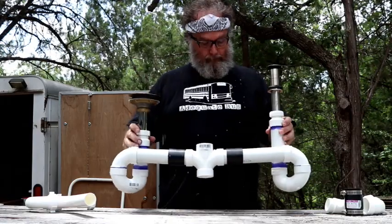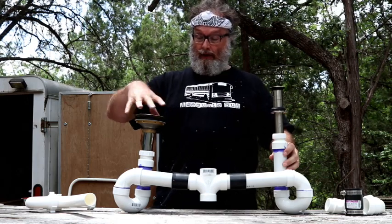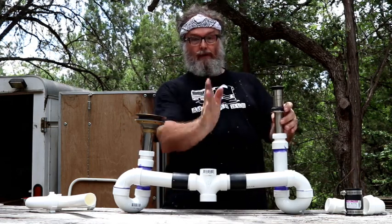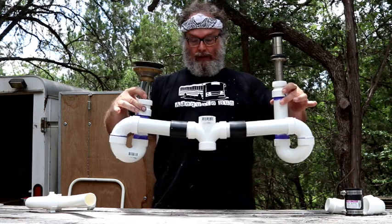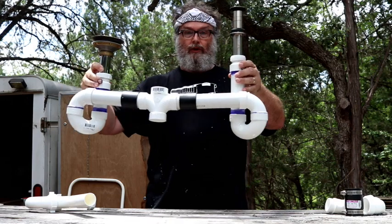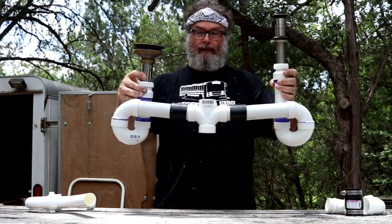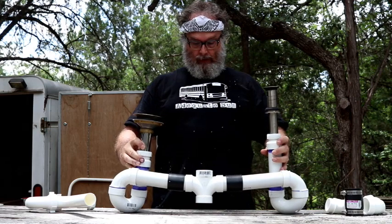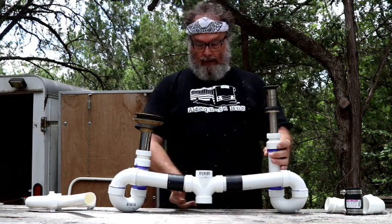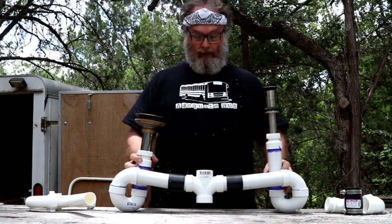Here's another assembly. This is the kitchen sink, which is a very deep sink. This is the bathroom sink. There's a wall right here — a hollow wall. You can see the P-trap for the kitchen sink, P-trap for the bathroom sink. They both go into the wall and into a radius stack T. This will be the drain vent. It goes down the wall and then out the roof in the back.